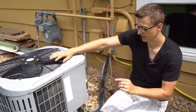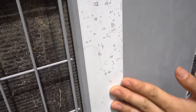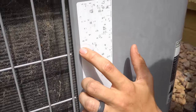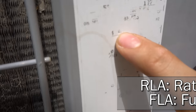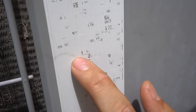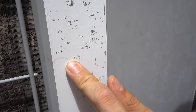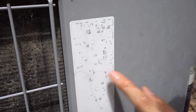Before we begin I just want to look at two ratings on the nameplate right here. This sticker has been sitting in the sun and with time it faded out — you're probably not going to be able to see the numbers but you can still read them. In the section that says compressor we have our RLA, sometimes it'll be FLA. This stands for rated load amps. This is at 10.4, and that means that while the unit is running the compressor should be drawing less than 10.4 amps. If it's over that, the compressor will start to overheat.